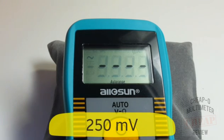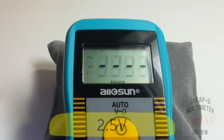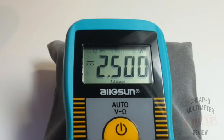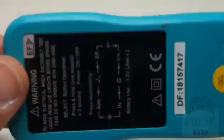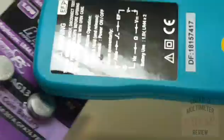First up is DC accuracy. We're in auto-range setting, and as you can see it is unable to figure out what a millivolt is. Switching to the 2.5-volt setting manually — it's thinking — and there we go: 2.50, pretty well spot on. So in auto-range it cannot find that 250 millivolts, but no issues with the 2.5 volts.